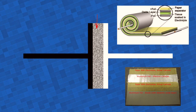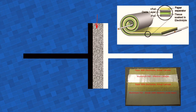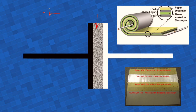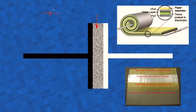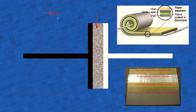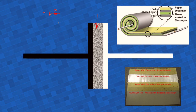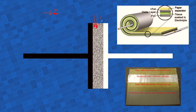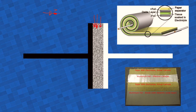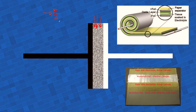The result may be almost as good as a new capacitor, but a condition for it to work is that the electrolyte cannot have dried out. If the electrolyte has already dried out, it's too late to reform. How do you find out if the oxide is still okay? You measure the ESR. Ideally for AC current of a given frequency there is no equivalent series resistance — no resistor in series impeding AC current flow. When the ESR is high, that's a sign that the electrolyte has dried up.